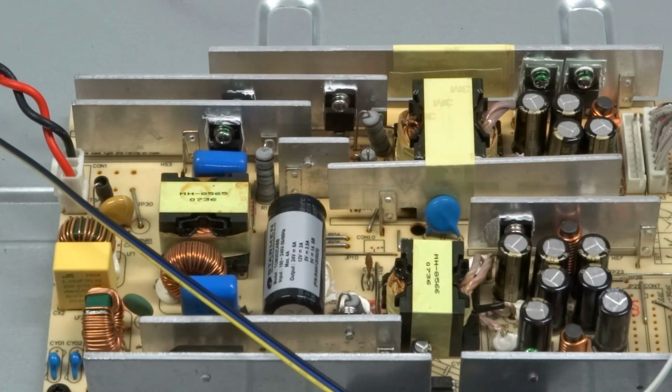Now, if the TV is designed properly, when you turn the TV off and unplug it, that voltage discharges off of there, but don't assume that the TV discharged that capacitor. It may still be charged. So I'm actually going to run an experiment here. I'm going to see how much charge is on that capacitor and how fast it discharges afterward.